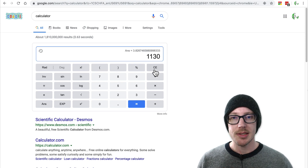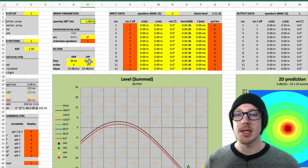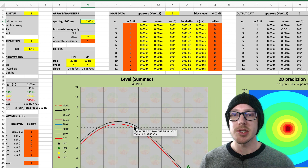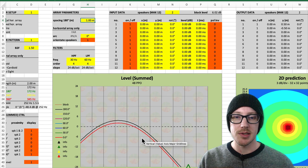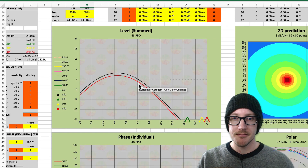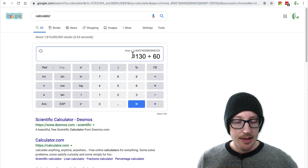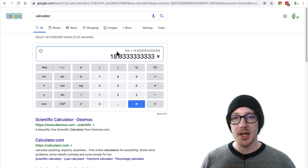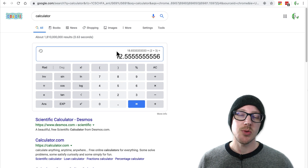What I want is first the wavelength of 60 hertz, because that's where the top of my range is. Pretty much the operational range is going to be from 30 to 60 hertz. So I get that wavelength and then I multiply that by two-thirds.